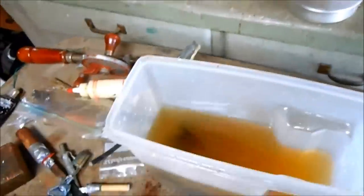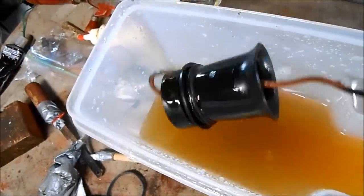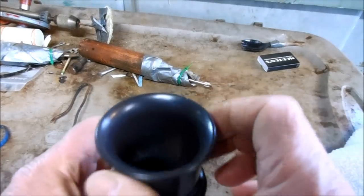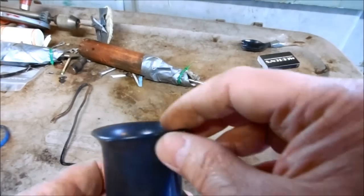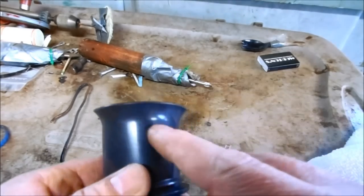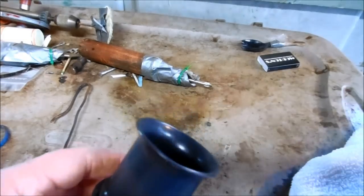I've had the rubber bits soaking for about 27 hours. Now it's time to fish them out and dry them off. The rubber still looks old and chalky, but it's been restored with the annealing and replasticizing process, so he'll be able to install these right away and use them for years. Since the outside looks a little dull, I think I might wipe some silicone oil on the outside so they'll polish up and look much better.